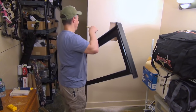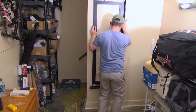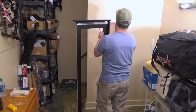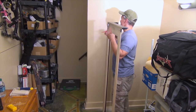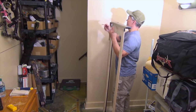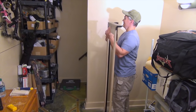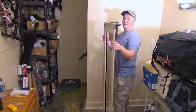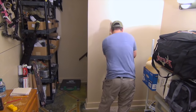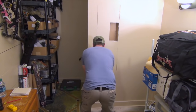At this point I'm just roughing out the hole for the insert, using the right stud as my guide — that'll keep the frame from sticking out past the wall on the left. The included instructions suggest using the instructions themselves as a template for cutting, but I think this way is much easier. The project just got extra interesting: as I suspected, the next stud is out here, but from here to here it's just a gap — just drywall. So I'm going to do a non-standard installation, which is going to be extra tricky.